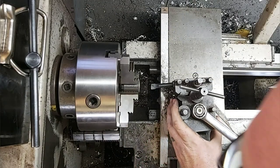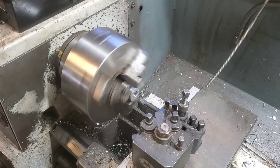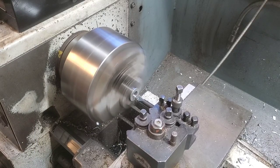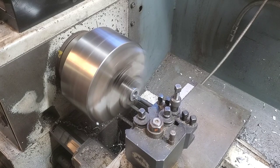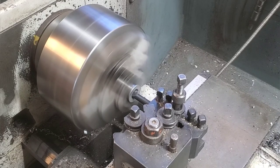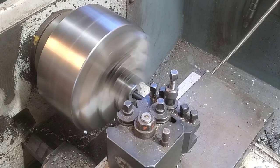If your height isn't quite on center, you're going to run into surface finish problems. Or when you take a cut, you're going to take off a little bit more than you expect because you're above the geometry. Speaking of surface finishes, this lathe is running way too fast, and I'm pretty sure a lot of the machinists are going to call me on this. I did a couple of cuts like this and I should know better. However, at least this is a good learning opportunity for you to see what to do better.